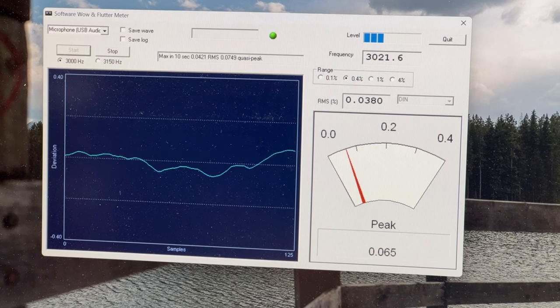And as you can see, I've got some markings here. It's because JVC used decibels for values in this thing. And I just figured I'd go in and convert these to voltages just so I would have a frame of reference here once I do the electrical adjustments, if I have to do them. Usually when it comes to full recap jobs like this, all I usually have to do is tweak the playback levels and recording levels, and that's all they need from there. But this one's auto-calibrating, so I'm worried about it breaking the auto-cal system.